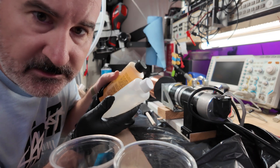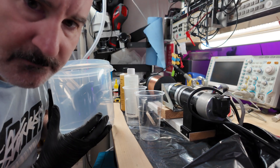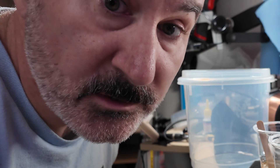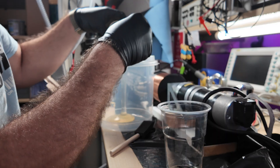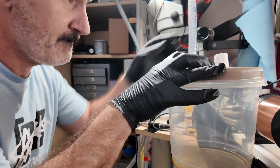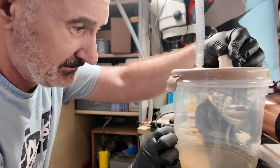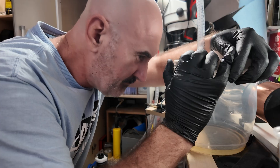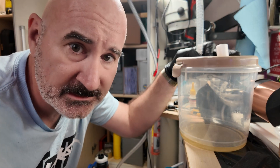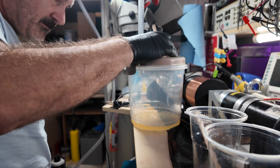We've got the two parts of the epoxy here. What we found before were tiny little bubbles, so I'm going to try and remove those bubbles using a vacuum pump — which is not necessarily a very good idea. I've got this plastic pot that I used for clearing the pipes in my dishwasher. There's a risk it might actually implode and spray resin everywhere. Confidence is low right now. Vacuum pump going on. I can't see too many bubbles — I think I'm not pulling a high enough vacuum. It's not foaming up. A few bubbles came out, but not what I was hoping for. Need to get a proper vacuum chamber. It was worth a try.